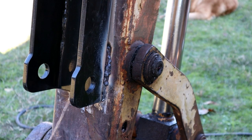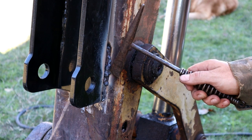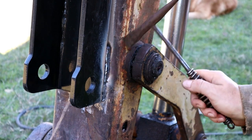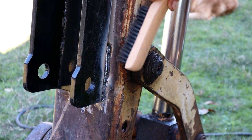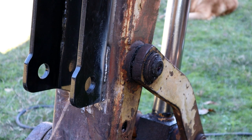Yeah, the coolest thing I've found with this 7018 is right now it just looks like a bunch of garbage on there. But you go to breaking that flux and slag away there. And underneath, you've got a really nice weld. I just find that really, really cool.